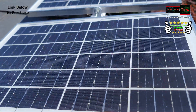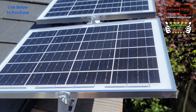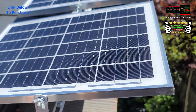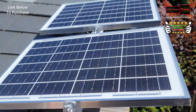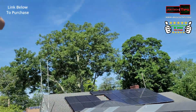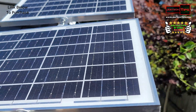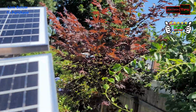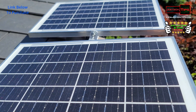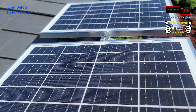And these are the solar panels. These are monocrystalline, not polycrystalline — they're black. I have them tilted in a specific way, because as the sun comes up further, I want it hitting the panel more. The sun is actually coming from the east right now, and I have it in this position because later in the day, I want to get 100% sun on it.